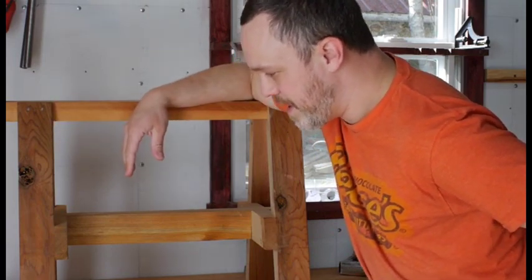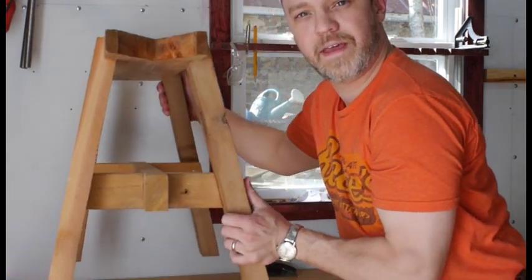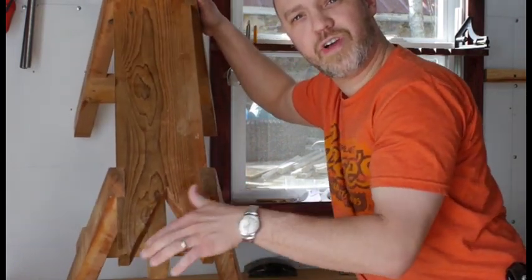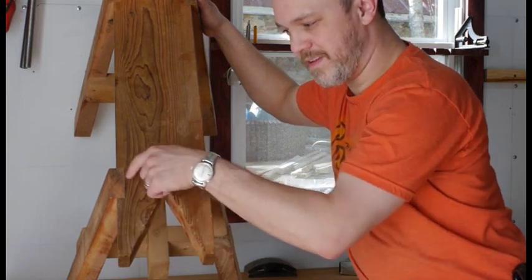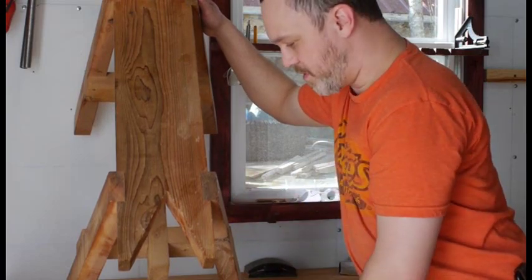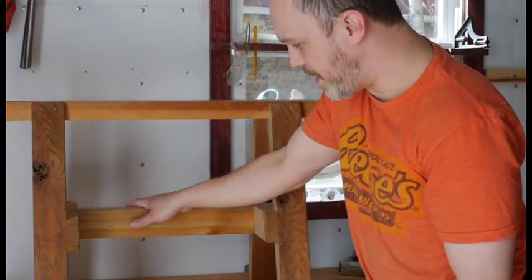I made it out of some scrap cedar so it's very light, which is great because you can sling it around the shop nicely, but it's very stable. It's an inch and a half thick cedar top and all the sides are an inch and a half thick. It's splayed out — you can see the splayed out legs right here, and that gives it a good stable base. Here is a notch that you can use for sawing. It gives you a little bit more of a starting point on some small boards. The legs come up flush across the top and are inset into some mortise areas.